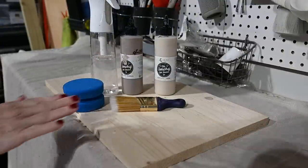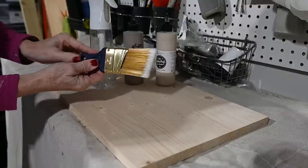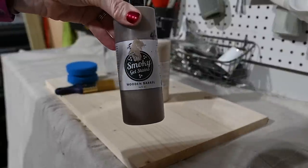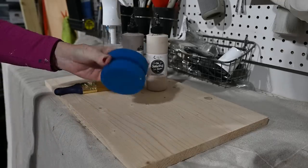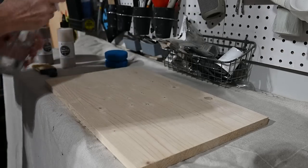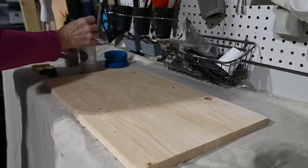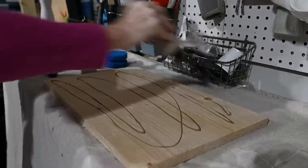I forgot to film blending the top, so I've pulled out a piece of pine to demonstrate. I'm using Lily Moon Old Smoky Gel Stains in the colors Wooden Barrel and Natural Cork, along with a water bottle, a nice brush, and a sponge to blend at the end. I've misted down the surface to give me a little longer to work with these water-based gel stains, then draw some lines going back and forth with the darker color and then the lighter color.